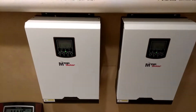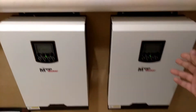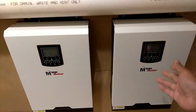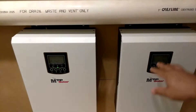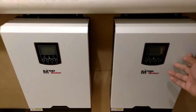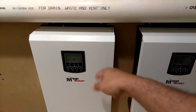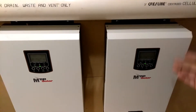Not all the loads are on at one time - some loads are on at a certain time, some at another. Basically, the reason I didn't want to parallel is I didn't want this unit putting out 600 watts when this unit was only calling for 400 watts. If this side was only calling for 50 watts and this one was calling for 150 watts, each unit will only put out what it needs to feed its loads.